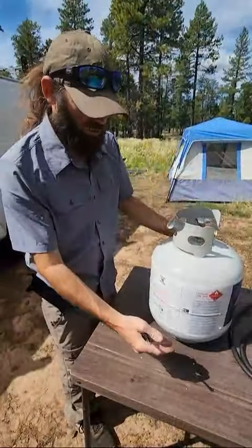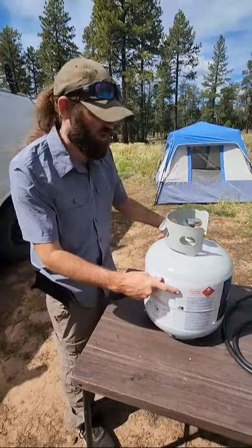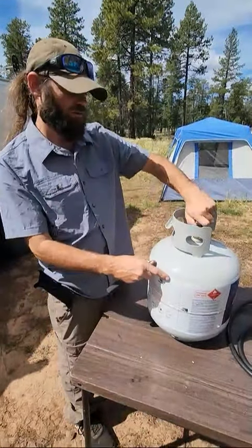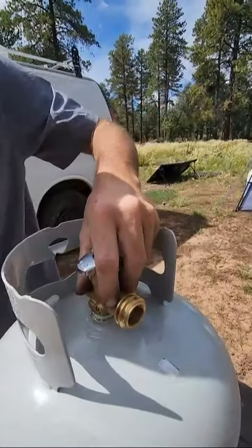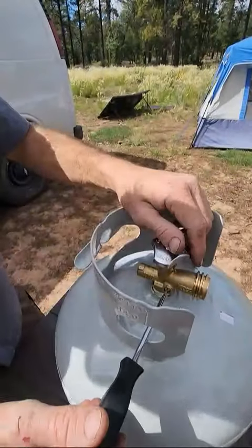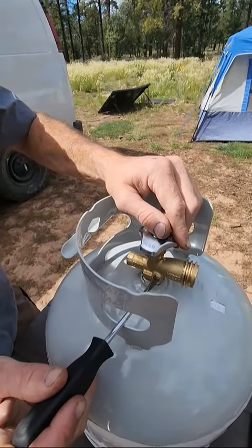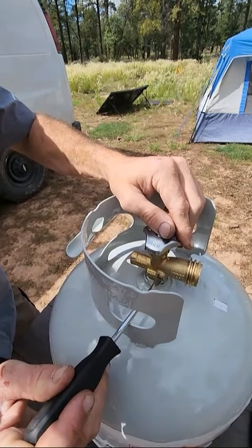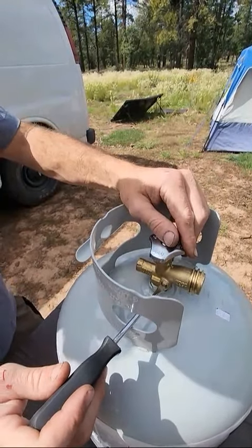So the fix for that — this is your 20-pound propane tank, this thing holds 4.7 gallons of gas. This here is your on-off valve, and right here in the center down on the side is a pressure relief valve. I'm just going to stick that screwdriver in there and turn it just a tiny little bit — like a quarter of a turn. Do not go any further than that, and let that sit for about 10-15 seconds while that lets pressure out of there.